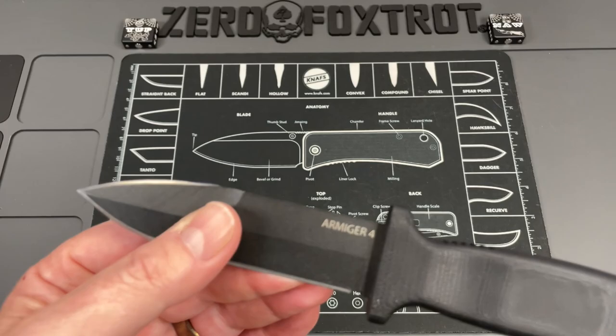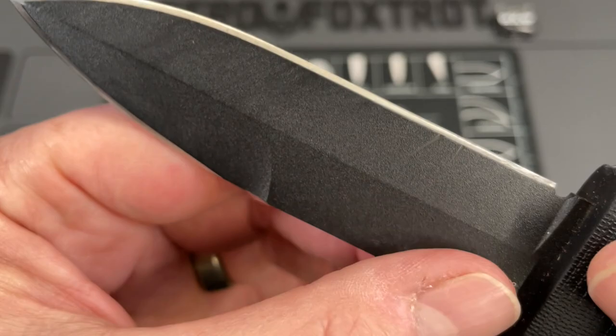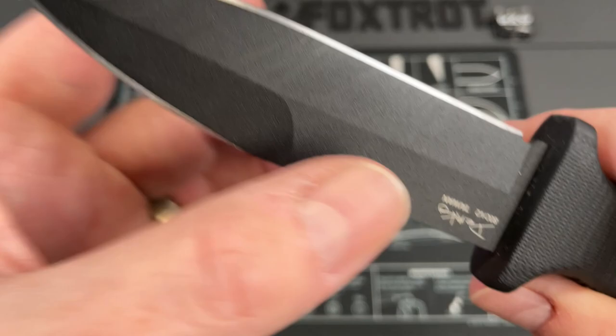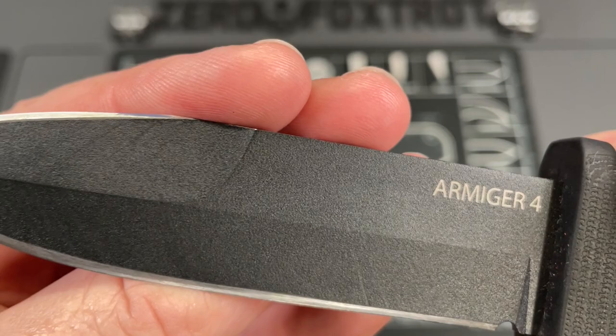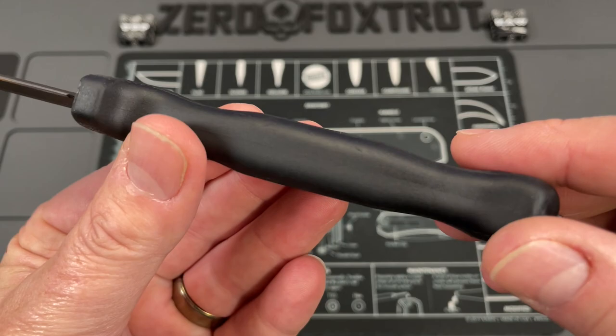Because the center line is visibly off, I had to do a lot of sharpening correction on this. The coating is really resilient — I did a lot of cutting and it only shined up; none of it started to cut loose or tear off. There are some deep gouges but it didn't give up. However, it adds a lot of friction when you're cutting. It's a very coarse coating, and it definitely makes it harder to cut with.